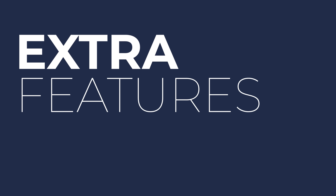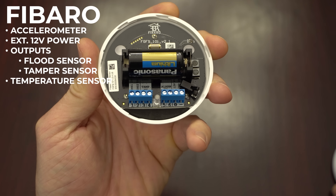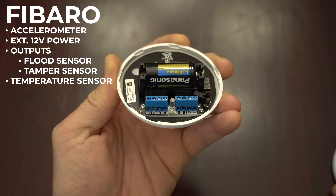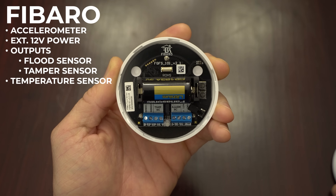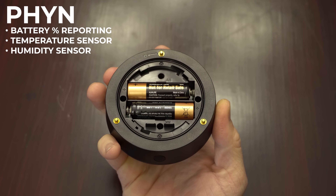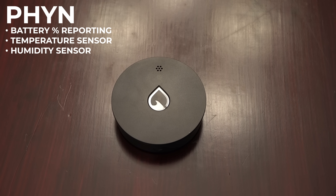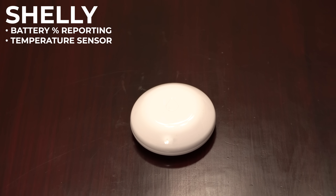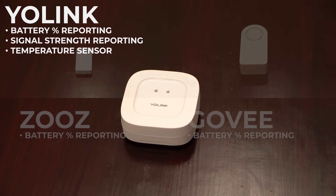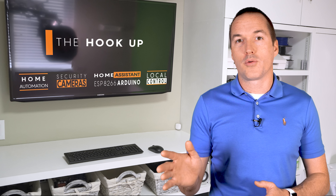The Fibaro is the Swiss army knife of sensors — it reports water detection and battery percentage, has an accelerometer for tamper alerts, supports external 12V power, has outputs for switching devices, and includes a temperature sensor with configurable audible alerts. The Finn has temperature and humidity in addition to flood detection, but the 2-year battery life requires disabling those features entirely — reporting once a day drops it to 1–2 years. Shelly can also report temperature but at reduced battery life. Yolink reports temperature, signal strength, and battery without significant power impact. Zooz and Govee only report floods and battery, and Beehive only reports flood with no battery display in the app.